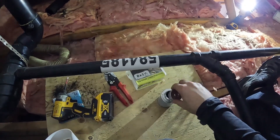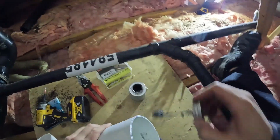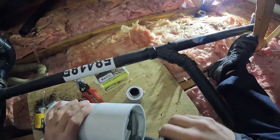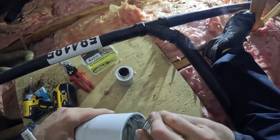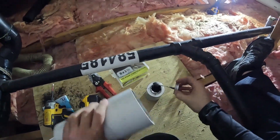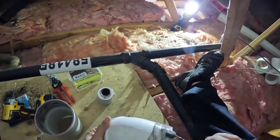Getting it professionally done is quite expensive, and with COVID renovations and maintaining the property we don't have a lot of spare cash, so I decided to attempt it myself. I went online — this is a four-inch internal diameter sewer pipe — and I bought a matching radon fan. I went with the RadonAway 145C model. For the 145C attachment you can just use a regular flexible four-inch to four-inch PVC connector; it'll work fine for your four-inch pipes.